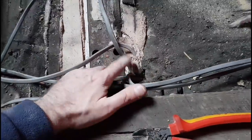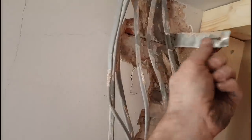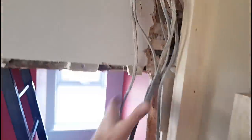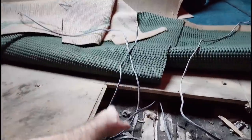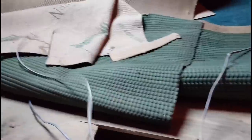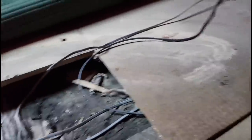I've exposed everything now in the front bedroom — you can see where they were going upstairs. In the cluster, they'd used some form of tin capping to hold the cables back, then pushed them down the door casing. I'm going to pull these light switches up and pull the rest of them up as well — move the switch for the landing and the bathroom. You can see I've fished up both sides of the cables now: the new one I fished up, and the existing one that was going down the hole. Same on the other side — a fished-up one for the new light switch position and the existing one.